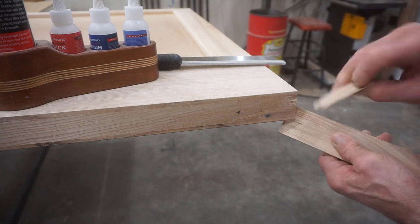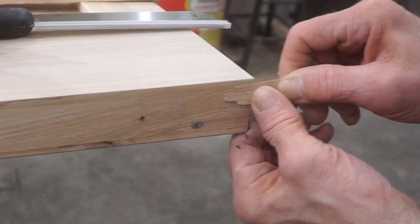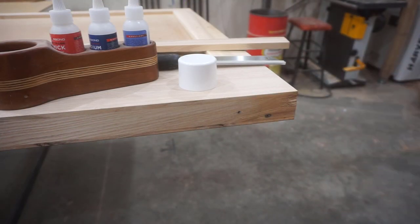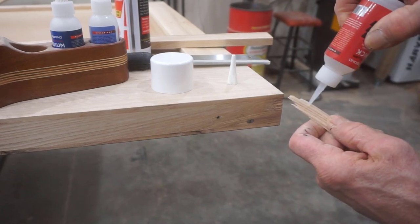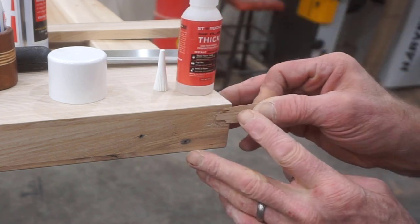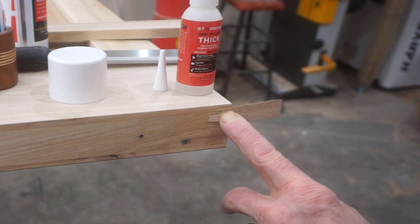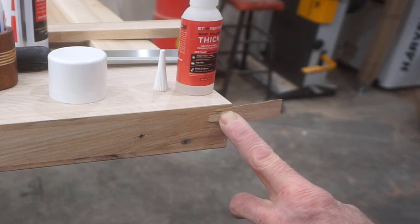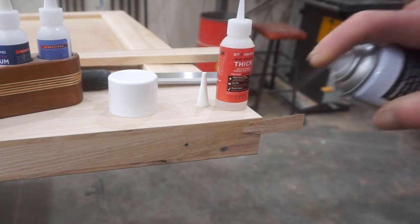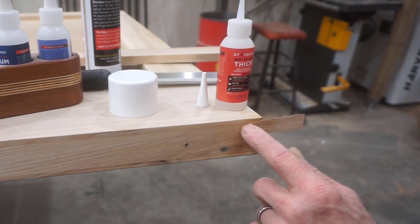To start off, I found a piece of scrap that had a similar color to the edge of the door and used the chisel to snap off a little splintery piece. The only piece that fits perfectly here is the piece that came off and I don't have that, but this is definitely a reasonable facsimile. Next I take Starbond Accelerator and spray the affected area. I'll use Starbond's thick CA glue and apply a very heavy coat to the splintery end of the little scrap, then stick it in place and hold it until the accelerator cures the CA. This is a good time to exercise hygiene, because it's just as easy to stick your finger to the door as it is to stick a wood scrap to the door.